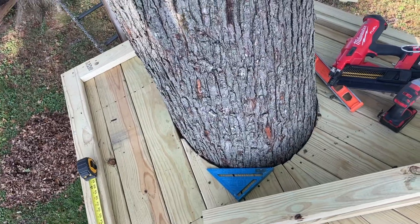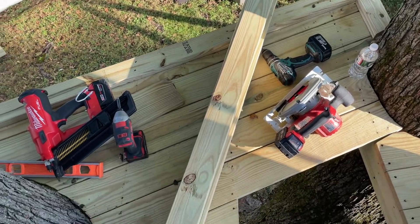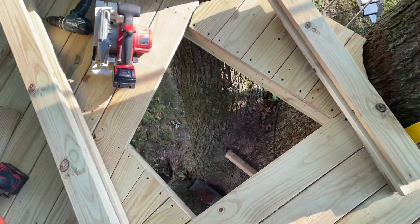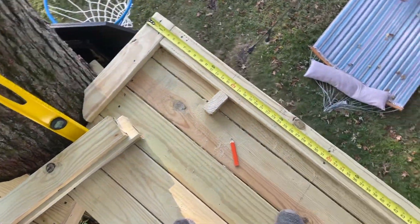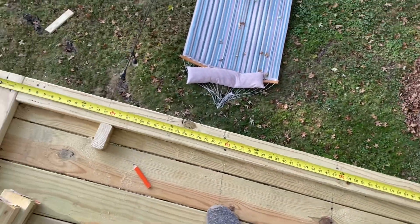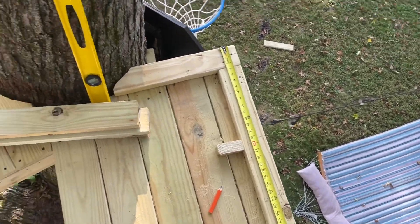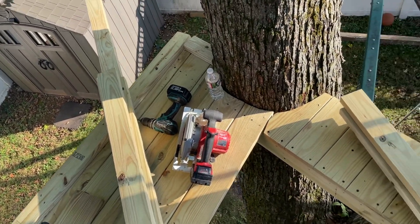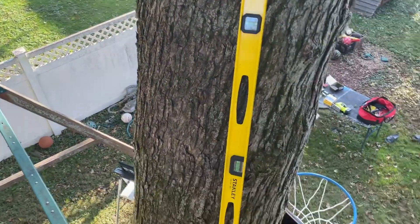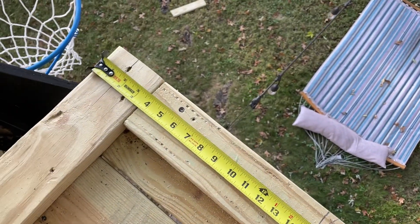So here's where we stand, guys. We've got the wall outlines done now — those 2x4s are already mounted — our entrance, this little extension here. Now I'm going to put up the walls. I'm probably going to go about 52 inches high facing this wall of the yard, and the back wall that's going to be covered I'm going to probably make it a foot lower, and just make a slanted roof going down on an angle like this. It'll be an easier design, probably more cost efficient.